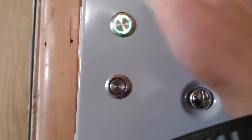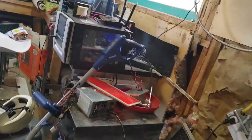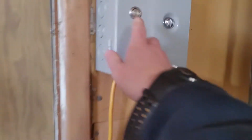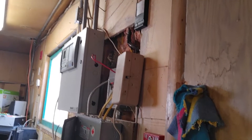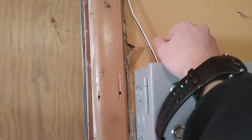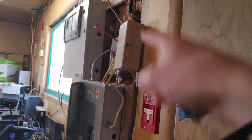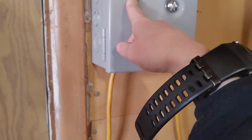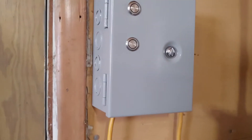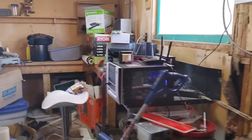It essentially is just an on-off switch using momentary buttons and relay logic to latch the relays. This button is wired in series with the alarm relay on the panel. If you're tech savvy enough you'll know how this is going to work. The stop button is essentially just breaking the circuit — it's wired in series with the panel, which is wired to normally closed. One of them will break the circuit and cut power to the contactor, releasing the latch. Look up how latching relay circuits work — I'm not going to explain it.